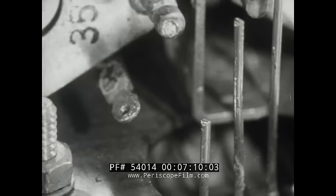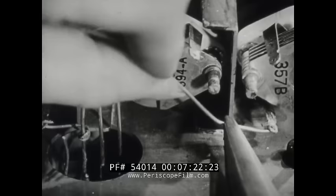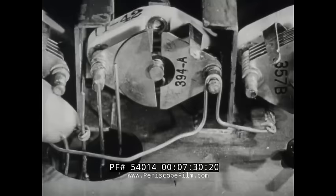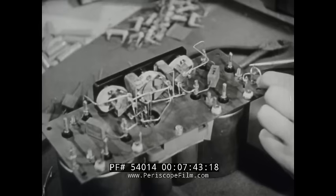Advantage may be taken of the hole to anchor the wire at the tip. Thread the wire through the hole and around the lug, then pinch it tight. Sometimes, where three or more terminals are to be joined, a single long length of wire makes a neater, stronger fastening than several short pieces. For an electrical circuit as simple as this, most of the connections are made first, then one joint after another can be soldered in rapid succession.